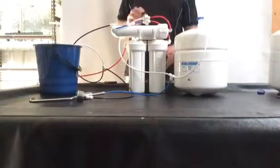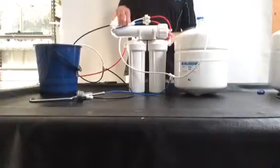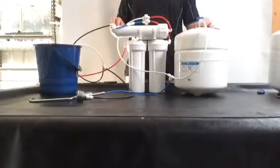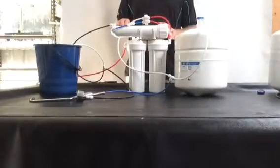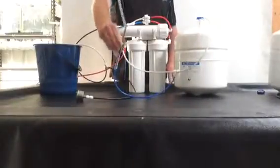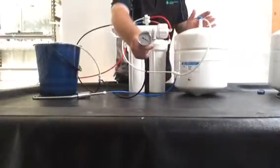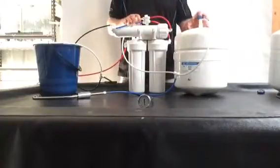What we have here is our four-stage USA reverse osmosis system. I've removed the top filter, which is the post filter or the last filter in line — the carbon filter — just to make it a bit easier for you to see all the workings of the system. This is the tank. The tank's purpose is to store the water, as the reverse osmosis system is quite slow. At the minute the pressure gauge is reading zero — the tank's turned off. This is the way the reverse osmosis system will be at most times, because the tank will be full and the automatic shutoff valve will be sensing that the tank is full and won't be letting water through.